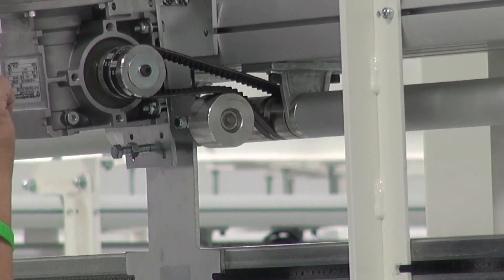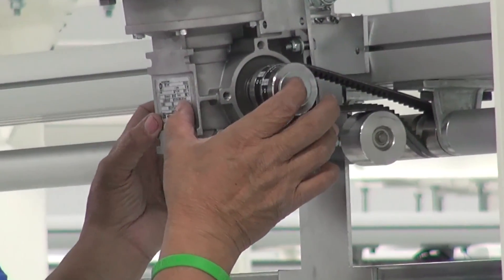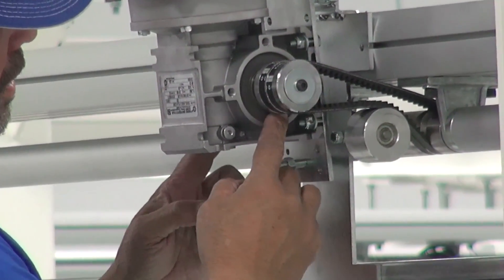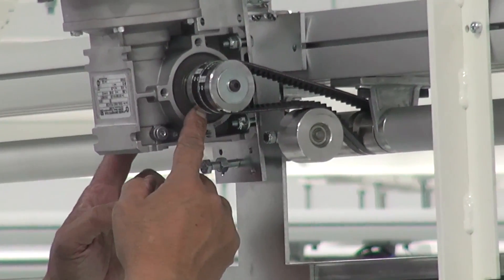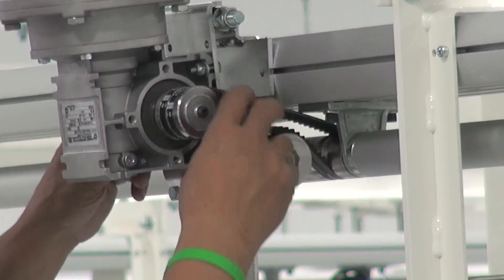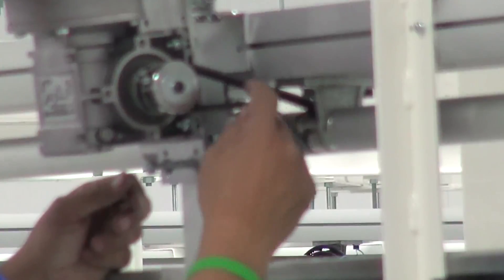You've got four belts on here and a common shaft that goes through the gearbox. If you get the tension too tight, you're trying to bend the shaft, and your oil will leak out from the seals. That's always the first thing you can tell — if you go to a job site and you see oil on the floor coming from this point, check your belts to make sure they aren't too tight. These belts should have about a half inch of play when you squeeze them.